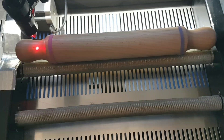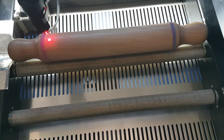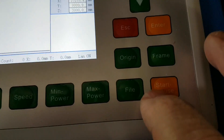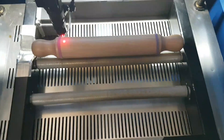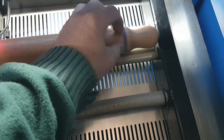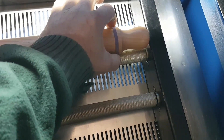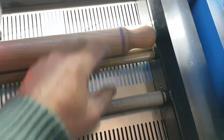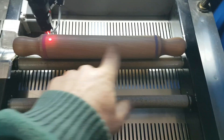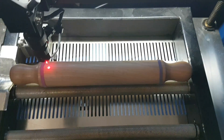I'll use the right arrow key on the display to bring the unit back into position to where I want it. Once I've got it there, I press the Origin button to set that as my new origin. But there's an important configuration in RDWorks first. I should explain the sizing — what you need to do is measure the diameter, multiply by pi, and that is then the effective height of what you're engraving.